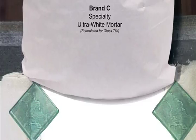making sure that your client is well informed over that so you don't have that call back. The other thing to be aware of on a glass tile installation is that they get full coverage. Typically on a tile installation, the industry calls out that the tile installation for a commercial application has to be 95% coverage on the back